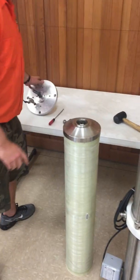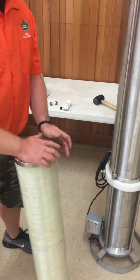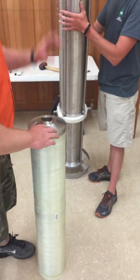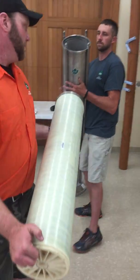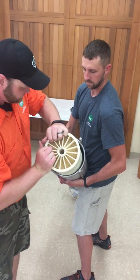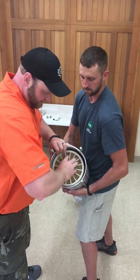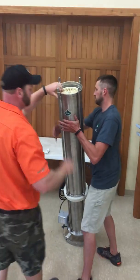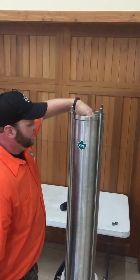The next thing we're going to do is actually put the membrane into the post. This is going to be a two-person job, so Eric's going to give me a hand here. He's going to tip the post down. The stainless cap adapter and everything goes in first — that goes to the bottom. I'm going to pick this membrane up and put it down into the post. Once I do that, I'm going to push on it and turn it a little bit to make sure that the stainless cap didn't fall off when putting it in. You're not going to feel it seat necessarily, but you'll definitely know if it's binding.